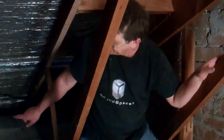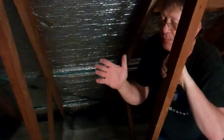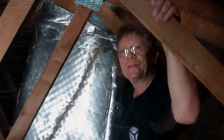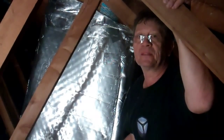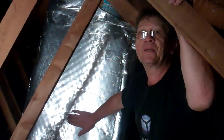At the end wall of the roof, we go right to the end and have to go down by 100 to 200 millimeters — between four and eight inches — down. So we have one blanket which is sealed with very minimum gaps, giving really good soundproofing. Here we have a light well — a duct that brings light inside the house, but it also brings sound inside the house. So we had to put the same loaded vinyl material around it as well.